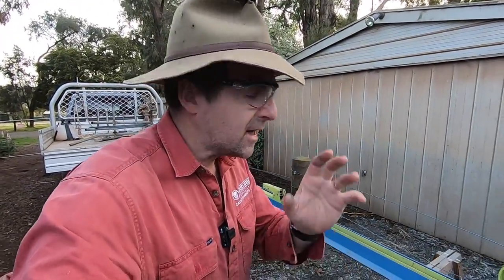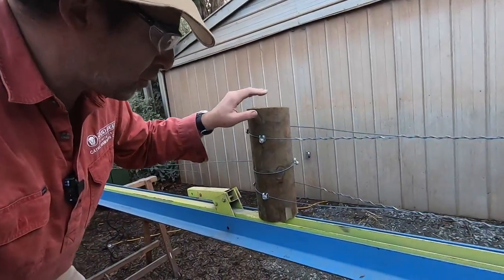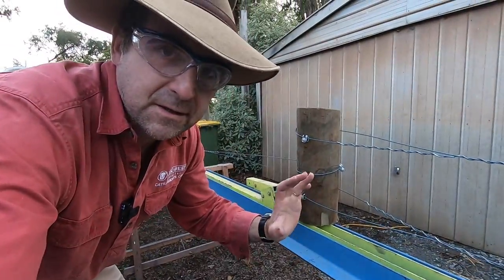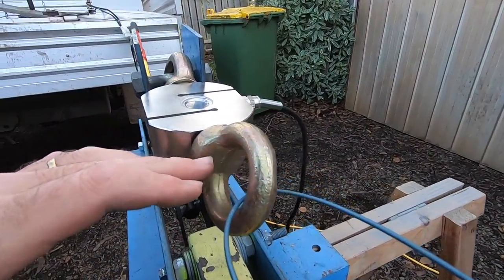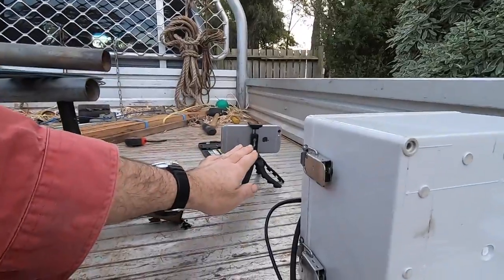Now that we've figured out how to tie the termination knot, let's test it out. I'm very fortunate the guys from Spiral Fast are still loaning us their straining test bed. This test bed has a pulley up one end attached to wire. I've put a little post in here that's got wires run around it, attached with Spiral Fasts to this pulley — that means we have the simulation of an end post in the middle of the test bed. We're then going to tie an end knot around this end post, and that is attached to a load cell which is connected to a digital readout box that tells us the tension on that line. I've got my mobile phone set up to record the tension on the line when the wire breaks. We want to find out exactly how much load the end knot can take.